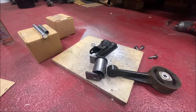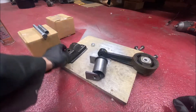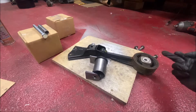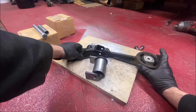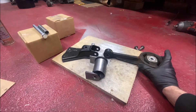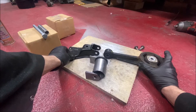This is how I'm doing my rear engine mount. This is the gearbox bracket from the 1.9 and this is the bracket from the car. The reason I'm using a mix of both is because where this bolts through is still the car, and obviously this bit where these bolt through is for another engine that's going in, so it's going to be a bit of a Frankenstein between the two. The problem is it sits a little bit further away on the car with the 1.6 in - it's mounting in a very slightly different place and it's also offset very slightly.